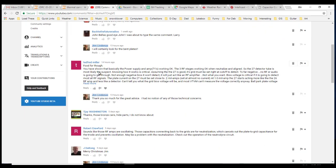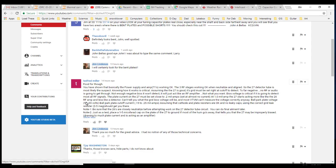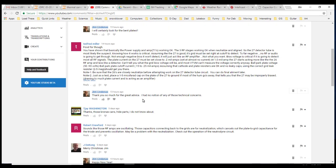Great. Now, Ted Fred Miller, you must be a real expert in this vintage of radio. I won't read this comment in detail, but basically you're pointing out that there's a lot of concerns about the operation of the 27, and to make it do its job as a detector, things have to be a certain way. You have a certain plate current and a certain bias voltage on it. And he's even warning here, hey, don't go sticking a VTVM on the grid and think you're measuring the voltage, because, of course, the VTVM will disturb the voltage. That's a longer comment here. So, probably in the next video, I will end up doing these things that Ted Fred is suggesting. As I replied to him, I had no notion of any of these technical concerns. So that's fantastic. Thank you very much, Mr. Miller.